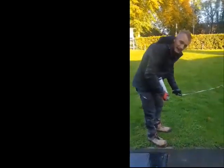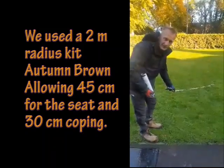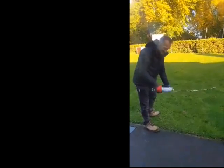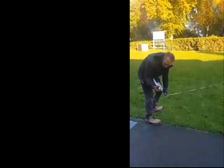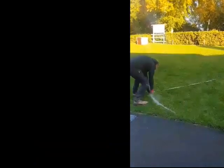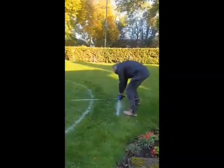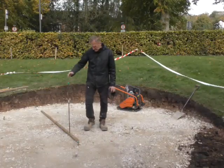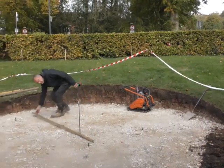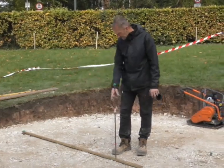We're going to do the marking out. It's a two-metre radius on this circular paved area, and then we've got the arc to do with the drystone wall. Keep the spray can close to the ground, two fingers on it, and keep it close to where you're working. We've got a trammel set to two metres, so we've got a four-metre diameter, two-metre radius kit.